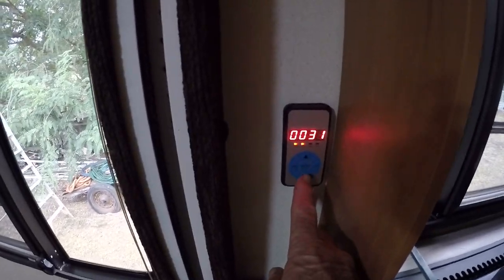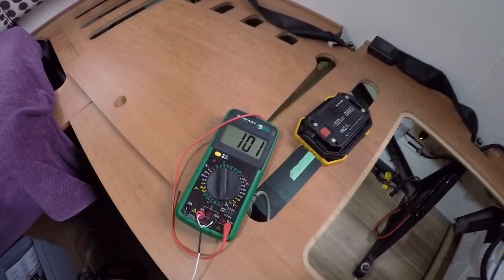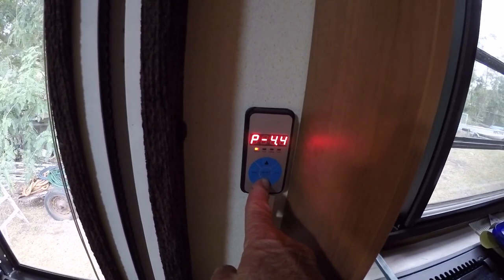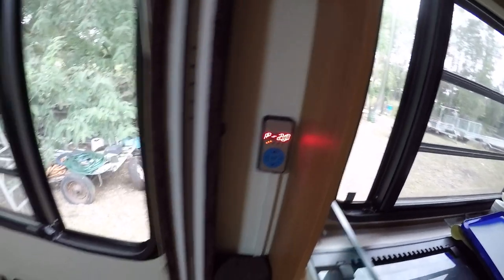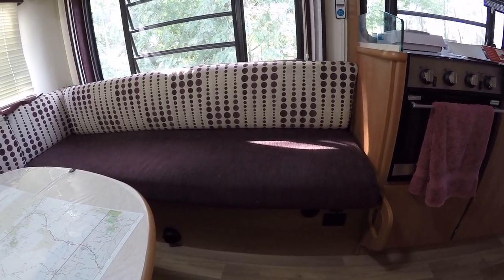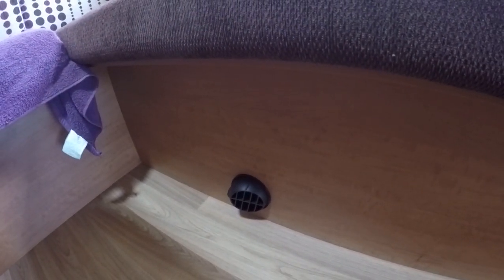We're running — very nice. Running at 4.9 to 5 hertz, putting out about 100 degrees Celsius at the vent. Outside it's single figures — about eight degrees Celsius — and inside it's very nice and warm. I'll run it down now to a low speed — down to two hertz — which will drop the noise and still give some good heat into the cabin.